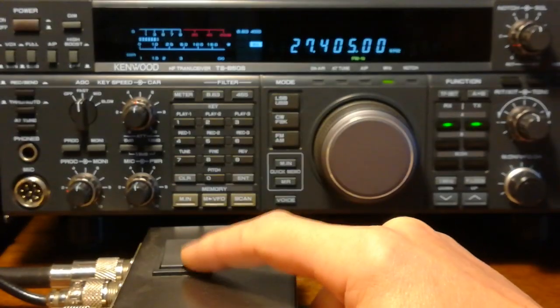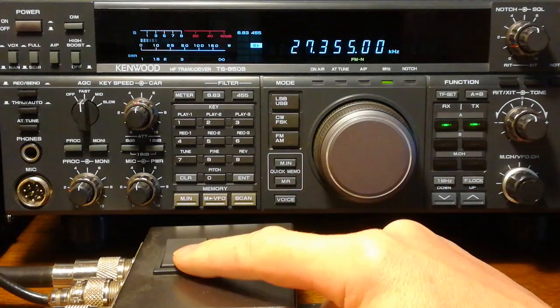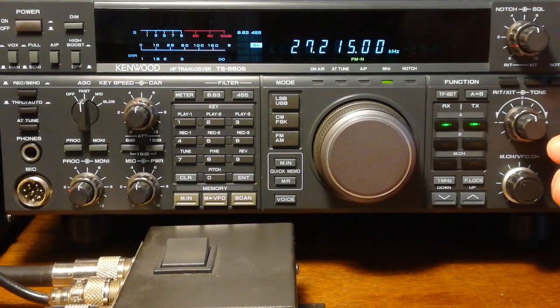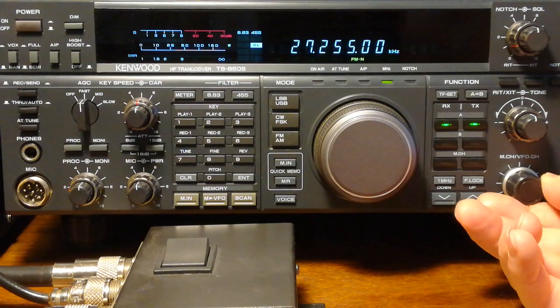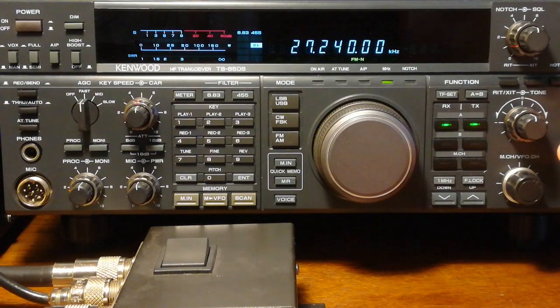So as I said, this front one here is the vertical. That's the Yankee. But we're well out of whack on the VSWR on the Yankee — well out. And it's beaming. I've got a picture where it's beaming now. I don't have a rotator on there at the moment, and I probably won't put one on. It's just going to be beaming to Europe basically — to the southeast, downwards France, that sort of area.